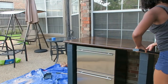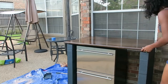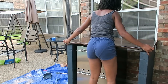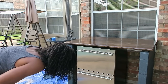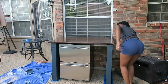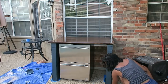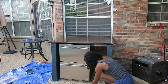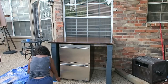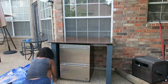I'm just placing the tabletop on. We do have a slight slope so we're trying different pieces of wood to see what will work to even it out, and then my husband will attach the tabletop. I also wanted to share that I used spar urethane to seal the tabletop because at first I used polyurethane and there is a difference. Polyurethane is for sealing furniture that will be indoors and spar urethane is for sealing things that will be outdoors — I learned something new during this DIY.